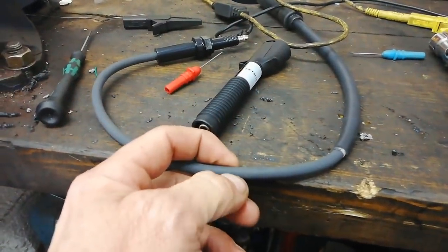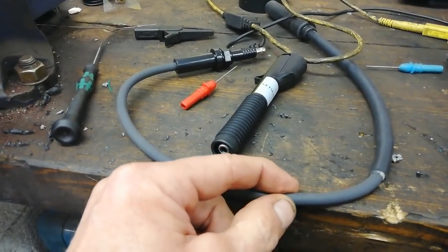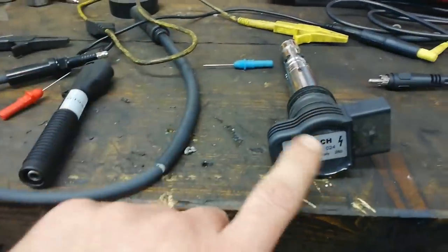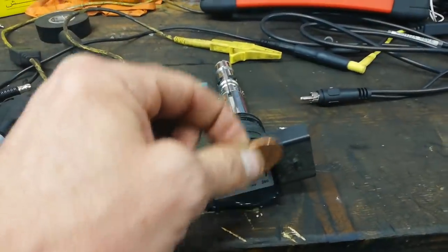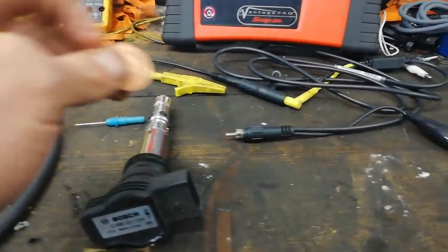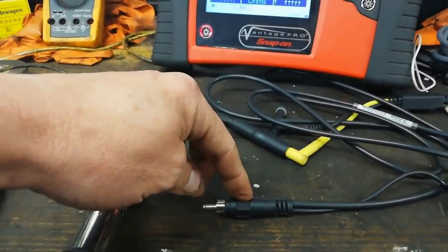The reason why you need it scope safe is if you had a break in the wire, if the insulation was poor and it arced into it, it would go straight up into your scope. Similarly with this type of test where you put the penny under that - if the dielectric is compromised, it arcs straight into your scope. Scope smoked. So built-in resistance protects that.